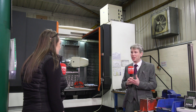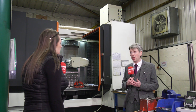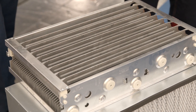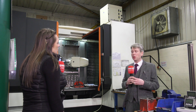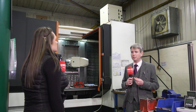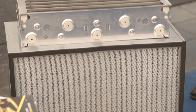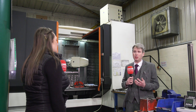You picked up on a couple of other aspects that are nice about the units. They are cheaper to run than conventional centrifugal style units. Using the electrostatics they don't have a large impeller that swings around and flings the material through a filter — they've got a smaller impeller at the top, which means they are approximately 50% cheaper to run than these competitors. Also the electrostatic cells are maintainable by the end user. A customer can easily maintain and clean their own cells — literally turning off the unit, discharging the cells, opening the unit up, giving the cells a clean in a small degreasing tank, then rinsing them off and putting them back in. It's a 20-minute process.